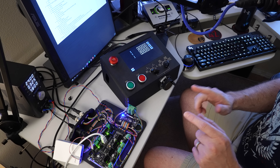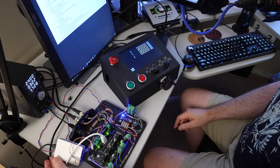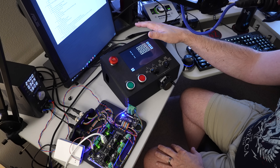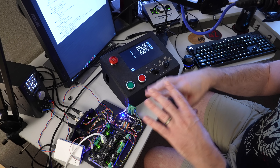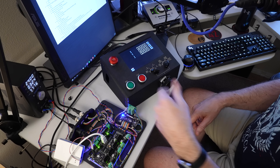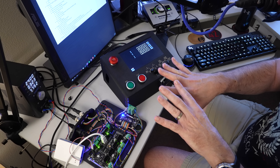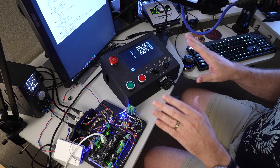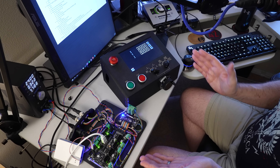We'll go over some of the more advanced features like the Atmel ICE debugging probe for debugging the controller in-circuit, and a logic analyzer for debugging the serial communication to the HMI. Powering this whole thing is just a little benchtop power supply outputting 24 volts at around 350 milliamps — not much, but enough to have a nice little workbench environment for software development so I'm not running back and forth to the machine.